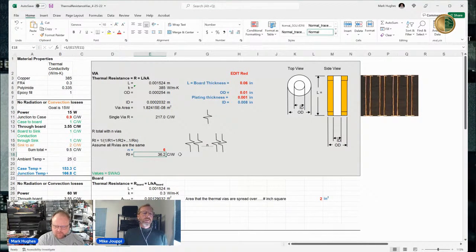Now if you look at that junction temperature and case temperature, just for a single FET with 15 watts — my highest junction temperature that I like to work with is about 125 °C. I didn't look up the max junction for this FET, but they typically run around 125 °C. A junction temperature of 166 °C is a bit of an issue. When Sven ran his design, he couldn't run the full 15 watts. He had a case temperature of about 125 °C measured with an infrared imager.